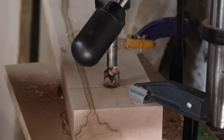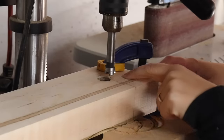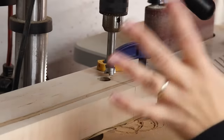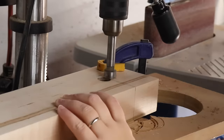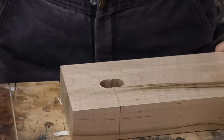I'm using a really dull bit and it's burning like crazy. I moved the board over to that second quarter-inch line that was offset from the original two and three-eighths line, and now I'll just drill that out to elongate the hole. Then I'll use a chisel to clean up those two pointy parts to create the oval.